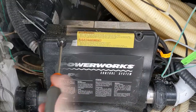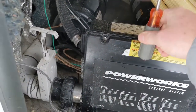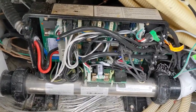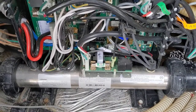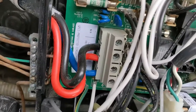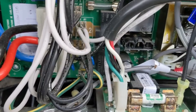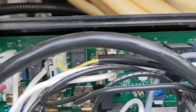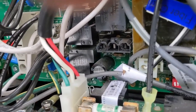Take the two screws at the top off and move the cover to the side. The first thing you're going to do when your hot tub's not heating is test the power coming in — right there, the leads. Test all those. If you have power coming in, then do a visual check of the green circuit board, normally around those relays.